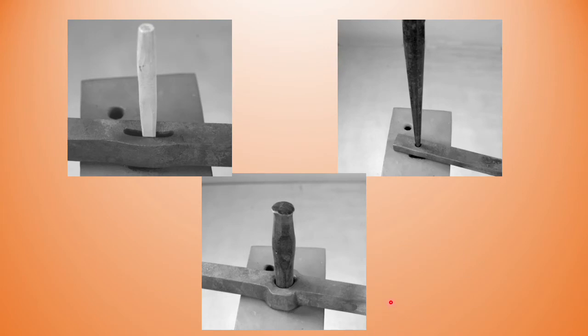As you can see from the top left photograph, the slot punch in this case is too big for the intended outcome — the slot punch is an inch or wider and the drift is half inch, far too much. Looking at the top right, that small hole would require way too much work to drift to one inch. The bottom photograph shows the top left result having been drifted to a suitable size, so there must be a relationship between the slot punched hole and the intended outcome.